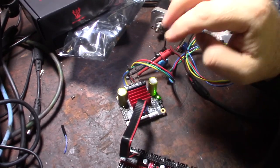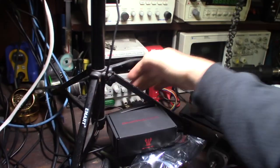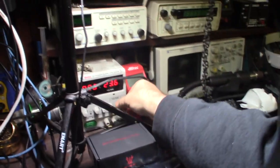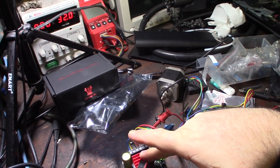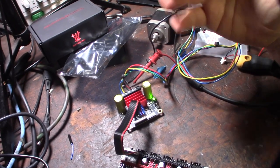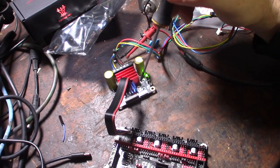All right, I'm going to go back, log into Klipper, and see if I can move these things. Obviously I'm not going to do any speed tests because I still need to order a 48 volt power supply. And turn this up to 36, whatever the max is. That's like 30, 32. And I'll see if this thing gets hot or not and how hot the MOSFETs get. Like I said, just the way it looked, even though I looked at the schematics, the manual's kind of horrible. So you can actually do UART mode. I'm thinking, the 5160 doesn't support UART.